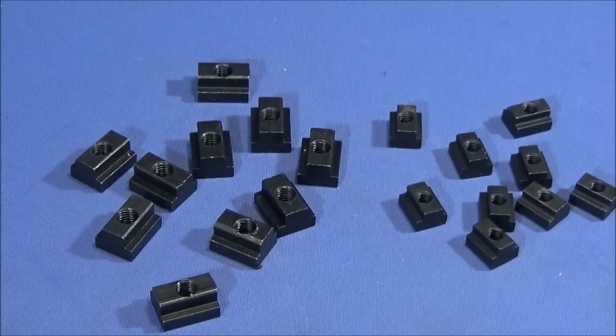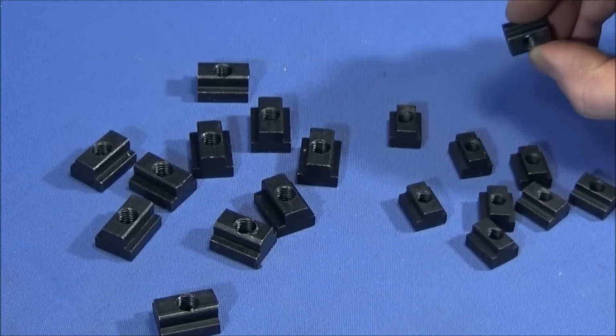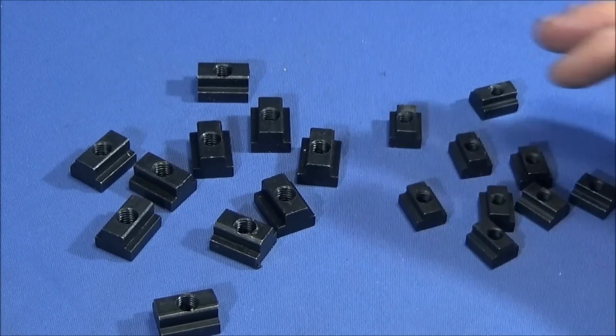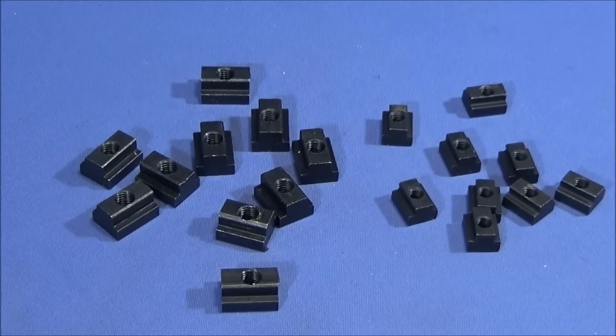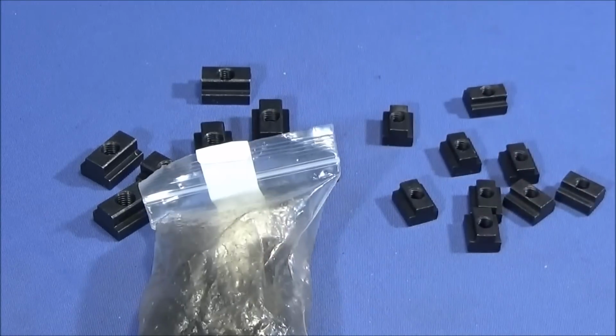Next on the list I have these excellent T-nuts for the lathe or mill or whatever, if you have slots in your cross slide or on the milling machine. One's in 8mm thread and the other's in 6mm, made by Matchifit. Really nice quality and an exceptionally low price for 10. And they're made of high strength, high carbon 45 steel, which is absolutely ideal for T-nuts. And when you actually see the price, it's actually well worth getting enough for a lifetime, which I did.